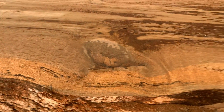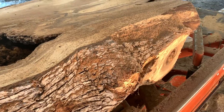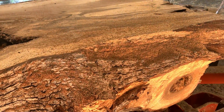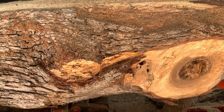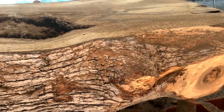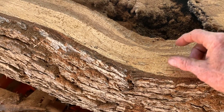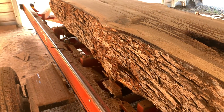So what I plan to do is flip it up and put this side up because it's a little bit straighter — I won't have to take near as much off, and there aren't as many knots. There's a big one down at the other end and there'll be some in it, no doubt, but this one will probably show through. I'm gonna square this face off. I have to set the pith again — it's crucial to get good boards off this side because it's so tapered on the other side. He only needs eight feet, and this log is 10 feet 10 inches, so he's got plenty to cut off. I'm just hoping to get two one-bys out of this side.